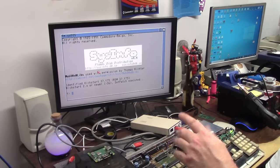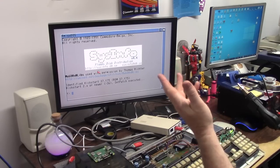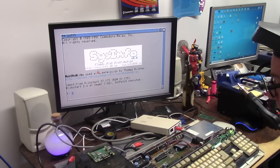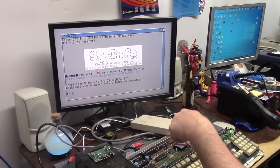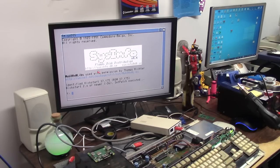That's why I didn't solder it in. They were just force fed, and it works. I'll solder in the round ones. The round ones will go into regular sockets. Now, it does go into a stock 68000 socket with the square pins, but you're going to be fighting her. Got to give it the old Tanya sometimes. You don't want to crack it.